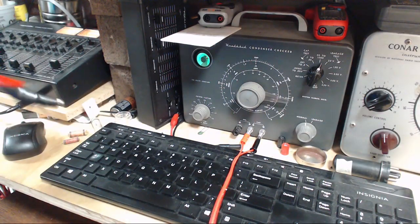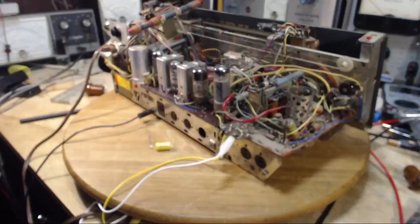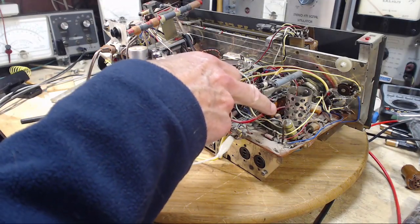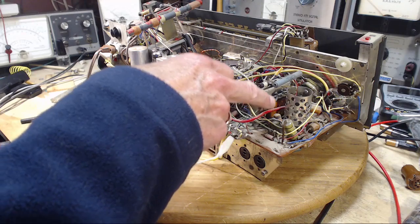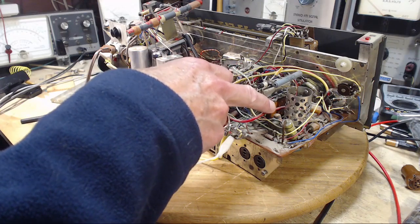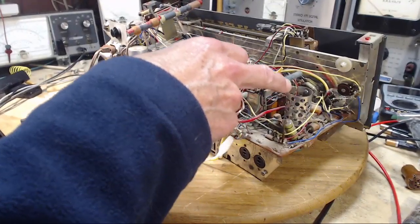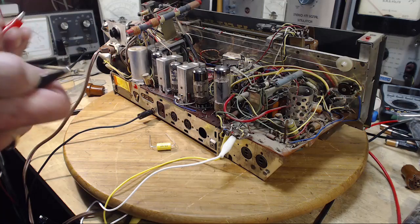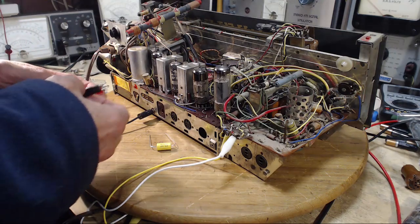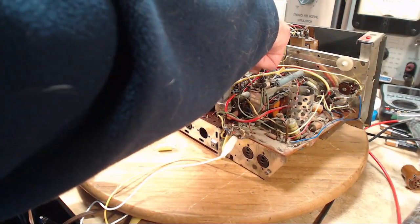And you know, it just won't stop there. Something like this, we could keep going, I'm sure. And this one has popped its top, and not like it was wonderfully hermetically sealed in the first place. But I think, by my analysis, it's popped its top because it's been overheated. The overheating is going to wear the capacitor out, he says with a dramatic tone of voice.